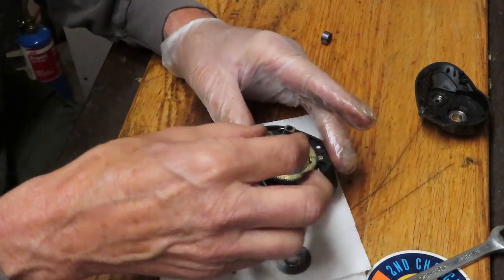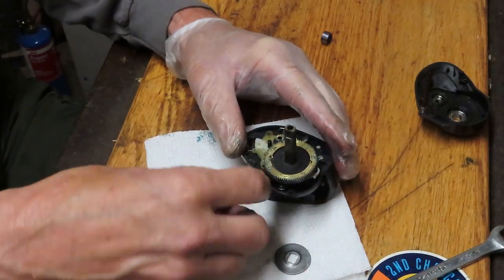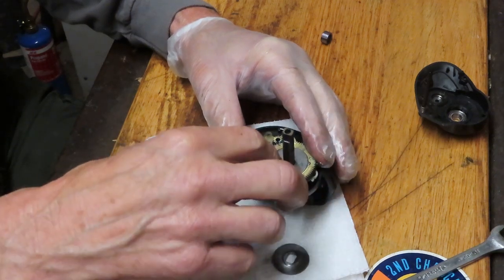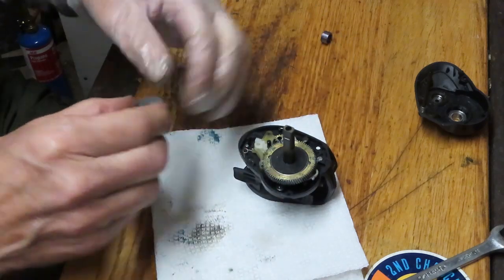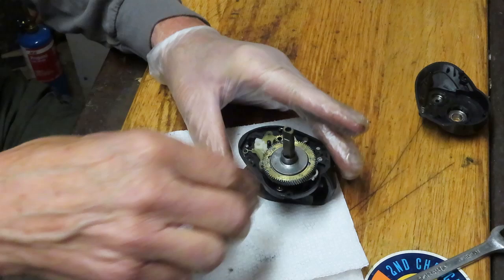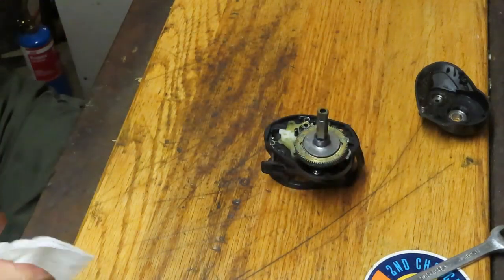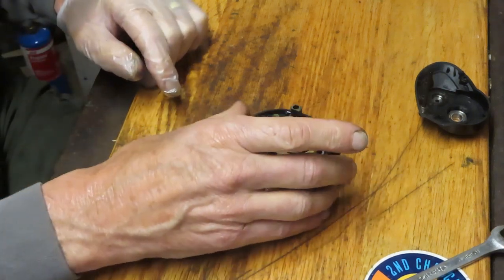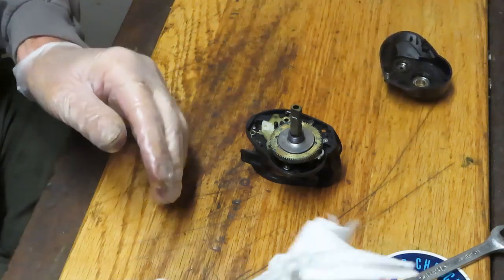First one on is the flat washer, rectangular. These are Carbon Tex. Again, you don't grease or oil a Carbon Tex washer because, well, it can't absorb it. So if it can't absorb it, then it makes no sense to use that grease or oil. And the purpose of the grease and oil is to keep them from tearing. Well, that's usually used on felt washers or the like. And it doesn't really have that same use characteristics that you would have with the others.